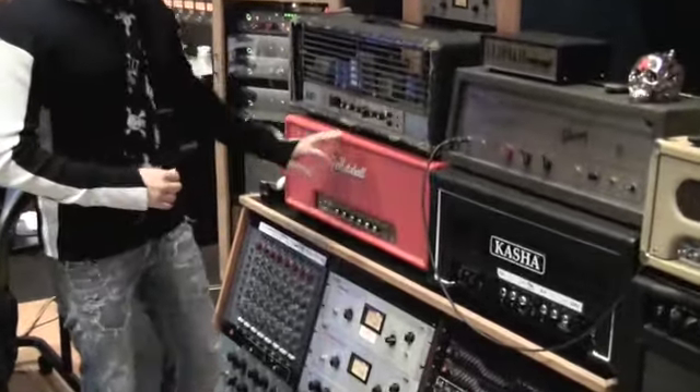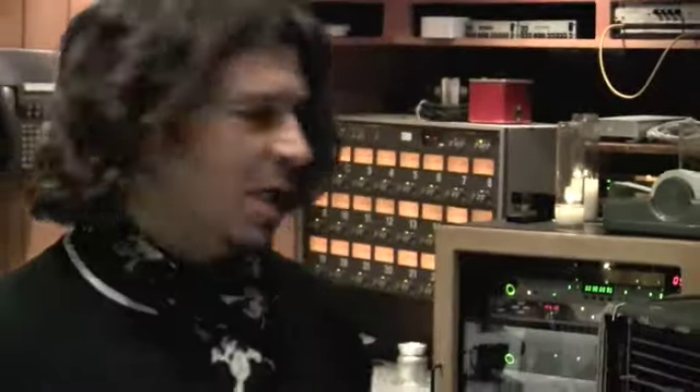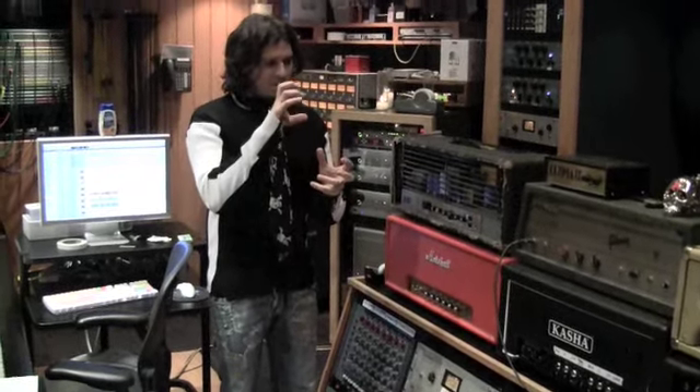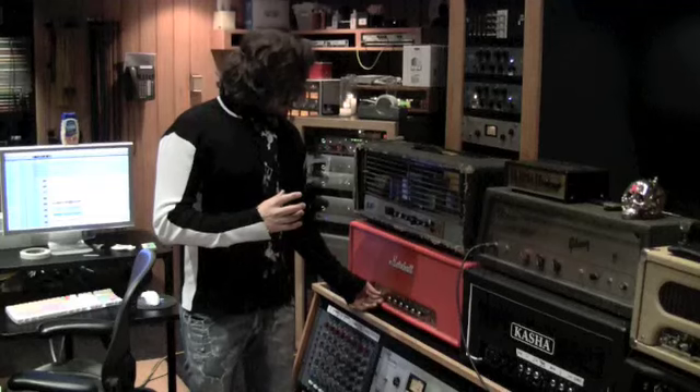This looks old, but it's a newer Plexi clone. A friend of mine in Toronto, Lou Ripolli, built this. We call it Big Red because it's red, and I love the red — I want to get a cabinet that matches but I can't buy one anywhere. It's like a traditional Plexi built to 1969 specs, but what he did was put a voltage tap on the power transformer. When it's in standby in the middle, going up gives you traditional AC/DC kind of tones, and when it goes down from 500 volts to 400 volts, it sounds more like Eddie Van Halen — all in one amp. Both sounds are awesome, and it's killer.